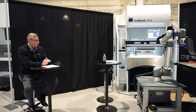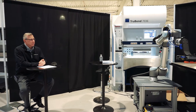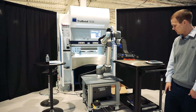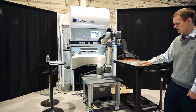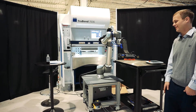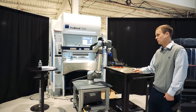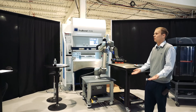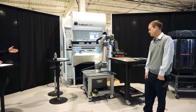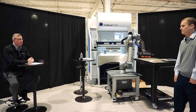It's on a mobile cart that can be moved and disconnected from the brake pretty easily. We have a heavy-duty mobile cart with self-leveling casters that bring the wheels up off the ground. So if you want to run your finishing machine or something where you don't have to have the robot very accurately placed, we can get the whole cart up off the floor. And you can disconnect it from the press brake and run the press brake in manual mode for short-run type jobs.